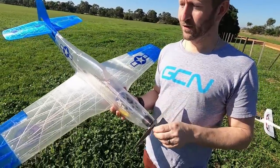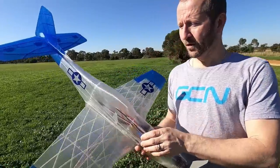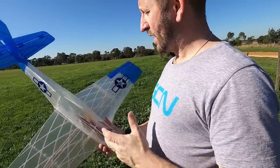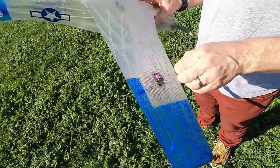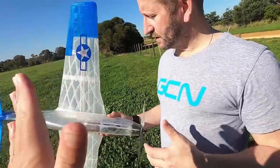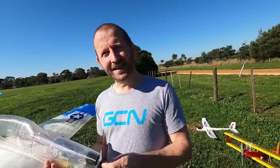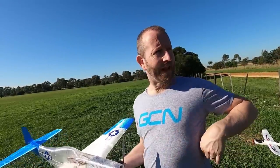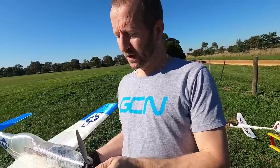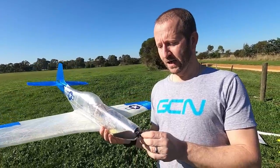When the parts pop off you do a little bit of cleanup with a scalpel to pull any frayed edges off, then it's a five-minute job to superglue it all together with superglue and accelerator. It's three servos — one for the tail and one each for the ailerons — bank and yank. Durability-wise for heavy landings I'm not sure; the intent is to be really gentle. We're on a field today that's not ideal, not nice smooth ground.